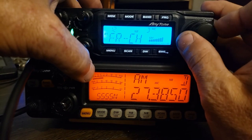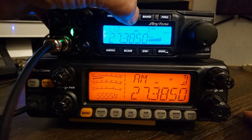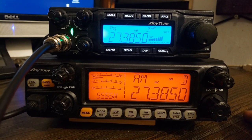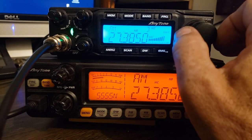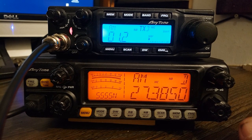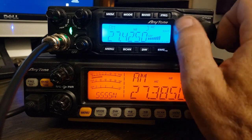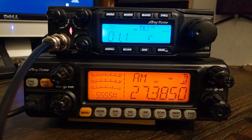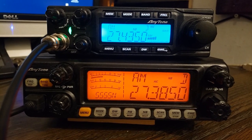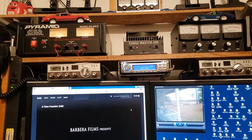Going to menu and find Indicator. Let's put that on AM. Grab the right microphone. Now I'm showing 1. Without the box on I was getting a 1.3; with it on I'm getting 1.1 to 1.2. But this antenna is tuned for higher up on the band.